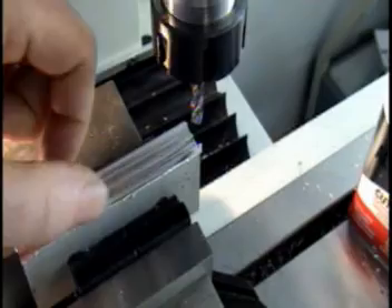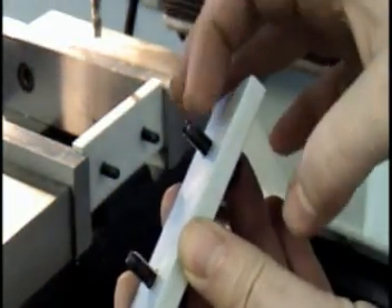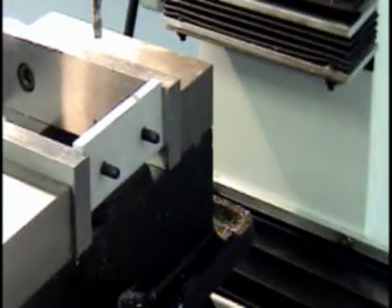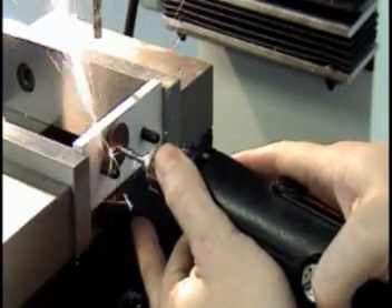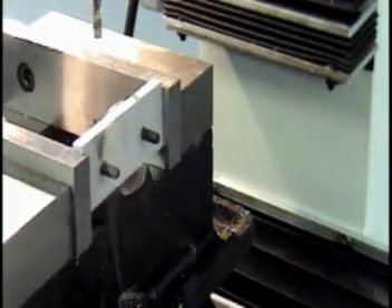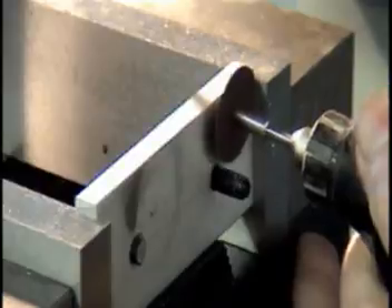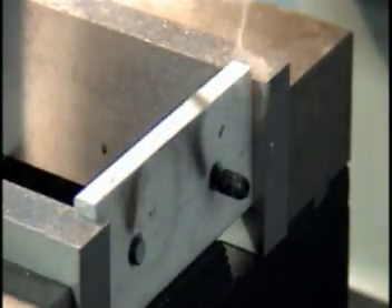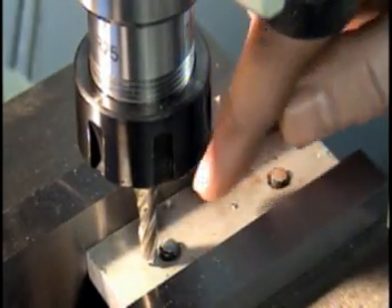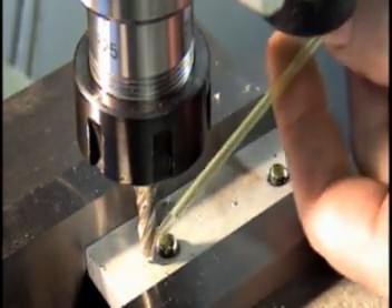Next I have to remove the material and do the deburring — you can see little sharp burrs on the edges, and you've got to get rid of them. Since these screws are going to go through the chassis and these blocks are going to sit on the bottom of the cabinet, I can't have them protruding. So I'm going to cut off the screws roughly first with a Dremel. After you get the notch, you can just bust off the screw. Now that the screws are cut off, I'm going to face them off with the mill so they're even with the surface of the metal block. I'll put a little dab of oil on here because this is a more aggressive cut.